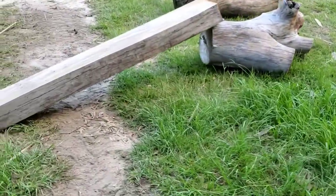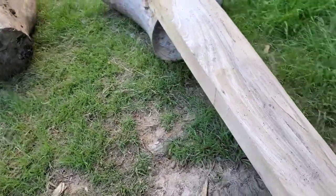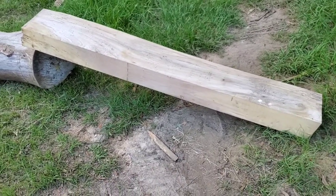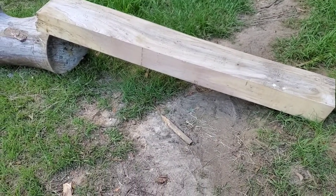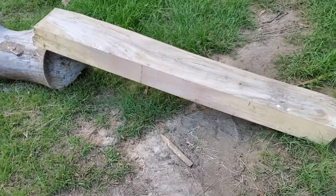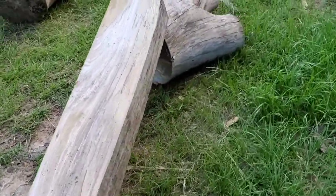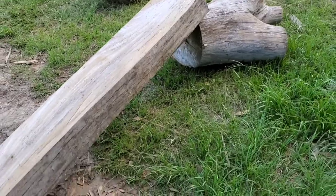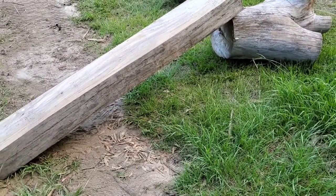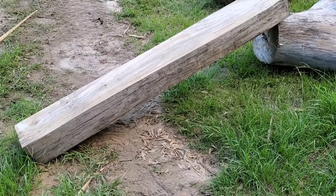We've got to come back over to this big hunkin' mantelpiece, which right now, when I looked at my measurement on the sawmill, it's actually not at 6.5 inches. It's 6 1/8 inches. So essentially, if we cut this in half, we'll have 2 3-inch pieces, and then a little bit of change. It'll be maybe like a 16th or something in there. So I'll put it to the 3-inch scale, and we'll see what we cut out of this. That should be pretty dang close. There might be a slight variation there.